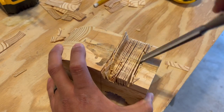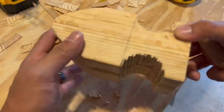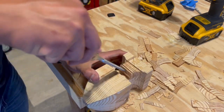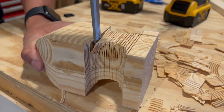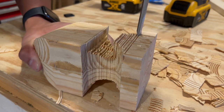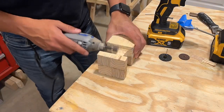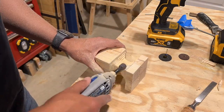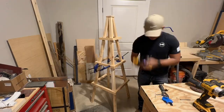After making all those cuts I grabbed a chisel and broke everything out on both sides. Then I had to mimic everything on the other two sides, so I went back to the bandsaw and cut everything together. After getting those pieces broken out and getting it to roughly the shape I wanted, I realized I didn't have a spindle sander. But then I remembered my wife has a Dremel, and it came with an attachment with a small sander. It did the job — very touchy trying to figure out the correct speed and angle, but we sanded it down as best we could.